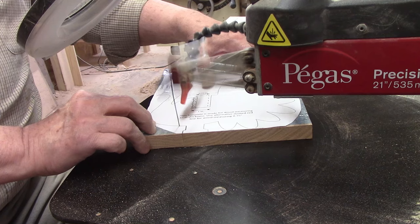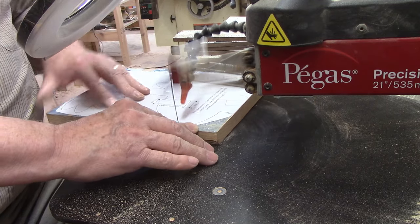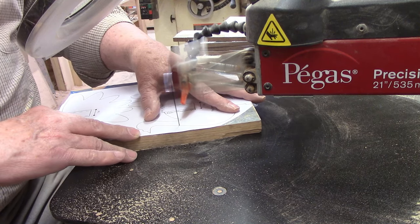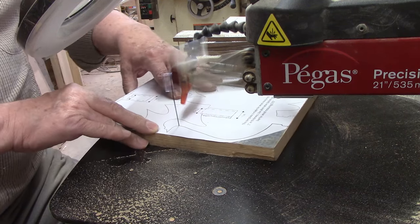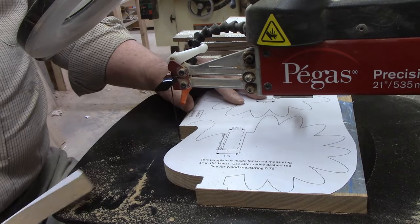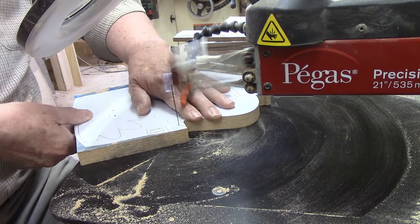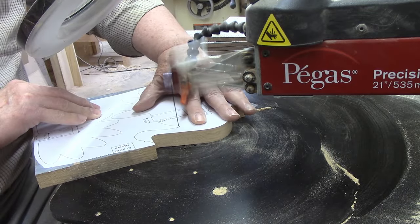When I attach the pattern to the wood, I ensured the bottom of the turkey's feet aligned with the edge of the board — that way I knew the bottom would be flat. The turkey shape is relatively simple, so all I had to do was follow the line and let the blade do the work. Don't try to speed things up by putting more pressure on the blade; all that will do is cause the blade to flex so you don't get a 90-degree cut, or it can cause the blade to overheat and start burning the wood. A third possibility is that too much pressure can cause the blade to break. When I got to the lower part of the turkey's beak, I kept cutting past it until the blade went off the side of the board. This accomplished two things: first, it allowed easy removal of the waste piece; second, it allowed me to make the angled cut for the upper part of the beak from the outside edge rather than trying to make a very sharp angle to get a point on the beak. From the back of the turkey's neck I cut down to that curve, which is easy even with the number nine blade.